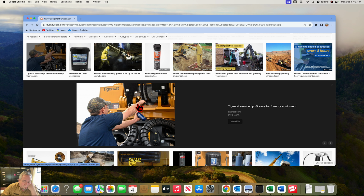Now, before you put a new tube in there, take and unwind the canister about 2.5 rounds. When you pull this rod out, it will pull air through the cracks of the joint here versus sucking all of this grease out of this line when it pulls a vacuum. It'll make it prime so much easier. So before you pull this bottom rod, loosen up the top about 1.5 rounds, 2 rounds, maybe 3 rounds. It's not going to hurt you. Then pull this rod and lock it.